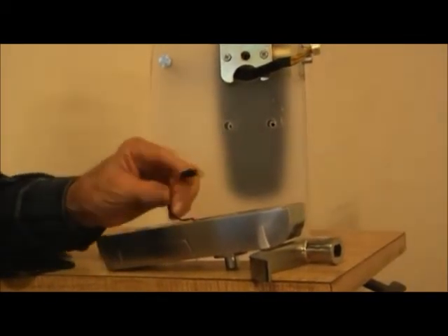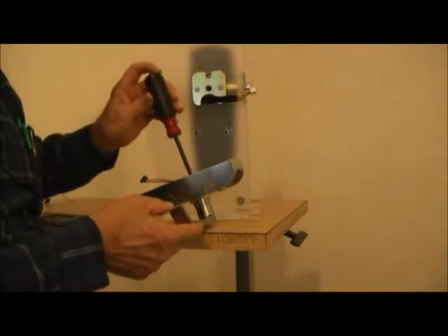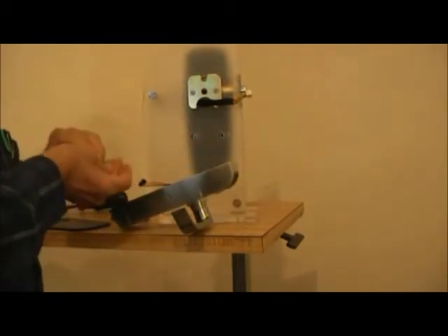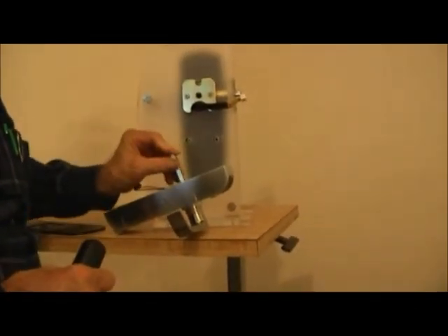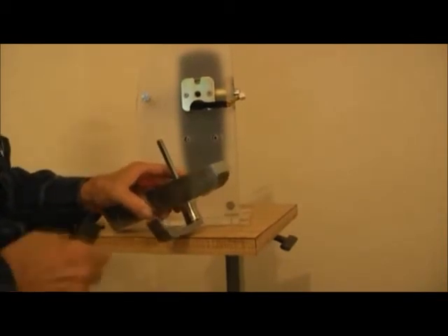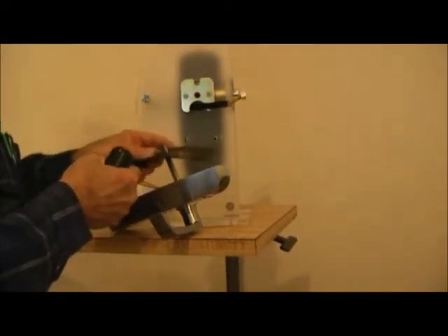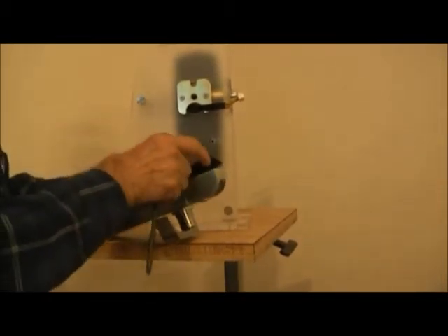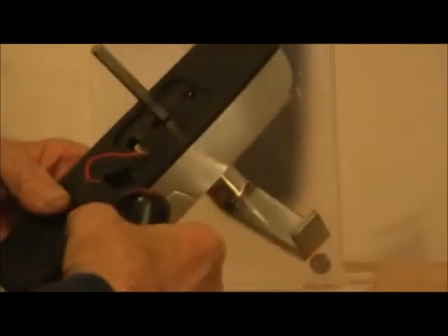Now you must drive the screw into the handle. We've removed the spring, screwed the handle down, then dropped the spring in above it. Now we're going to take the tail piece and insert it. Then take the rubber grommet and place it on the lock, putting it through the tail piece. Take the cable and put it through the little rectangular slot in the rubber grommet — that's how it should look.